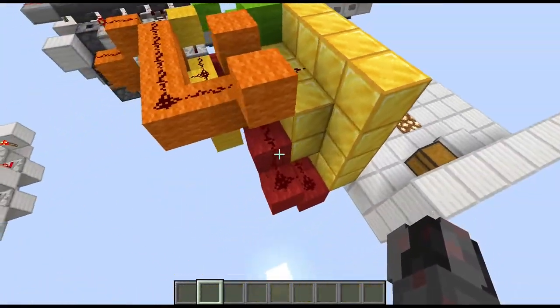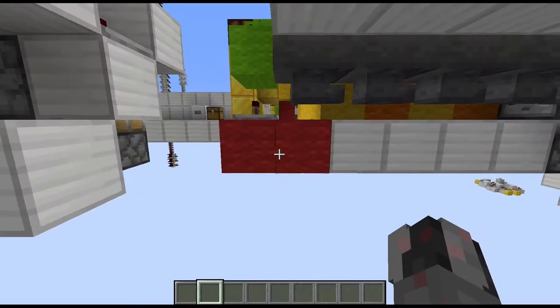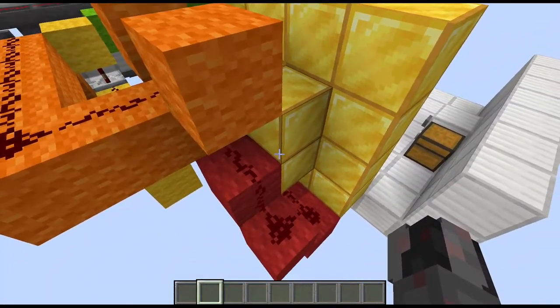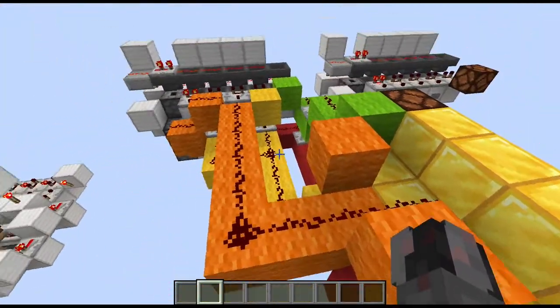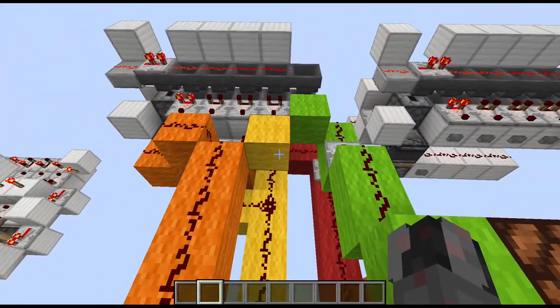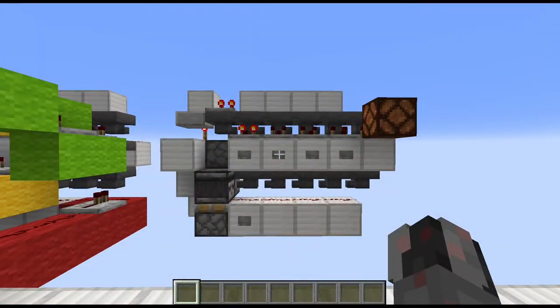Let me show you this in this example. The red line here is just non-used buttons, which are just running directly into this line down here — all the way from here. Since I'm not using any of the buttons at the bottom, I'm just connecting them directly. I'm also connecting the button at the right. The left and the top button in the middle are used for the combination, so I'm separating them out simply and running them into the corresponding blocks of the combination lock. And that was how you can build my simple and compact sequential button combination lock Mark II. I hope you enjoyed this little tutorial — see ya!